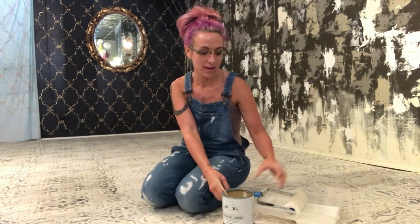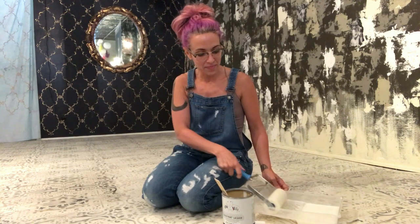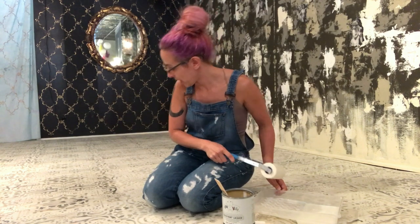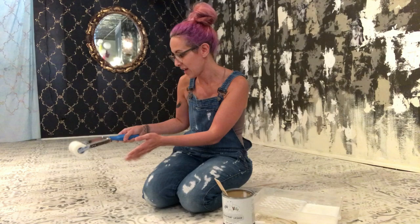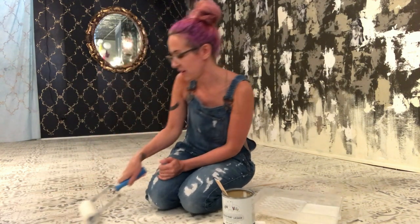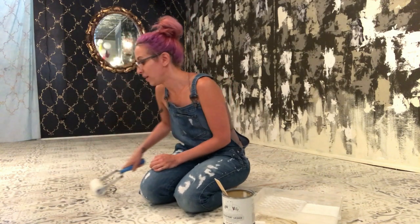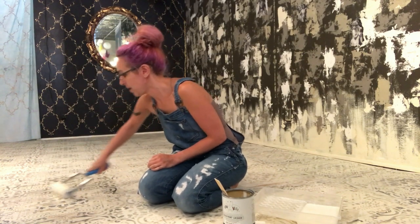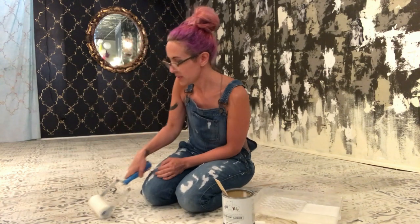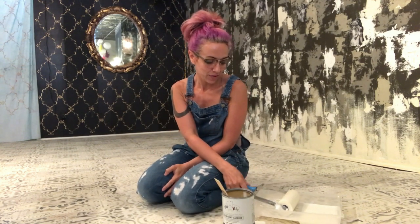I really appreciate all the feedback and thanks for watching. I can't promise to be organized or have a beginning and ending to anything I post, but anyway I'm going to show you quickly how I apply this lacquer. I choose a section that hasn't been lacquered and roll on a very thin coat. Unlike Annie's chalk paint, you do want to pay attention to how you're applying the lacquer, because if it were a dark color it could get cloudy if there's too much overlap or if the flattening agents haven't been fully stirred in. So I am somewhat deliberate with my application. Hope this was helpful — love where you live, shop local, and thanks for watching!